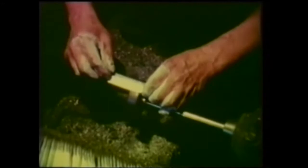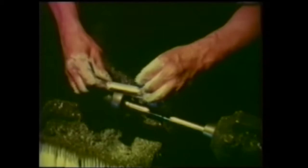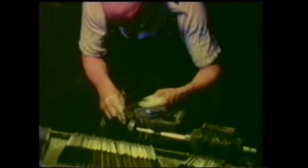After the initial grinding process, the blade goes through a number of other processes, of which this is one. Look how quickly he changes the position from one side to the other. The white on his hands is whiting — this stops the blade from going rusty. The time spent not actually on the wheel is considered to be lost time, so the quicker the changeover can take place, the better.